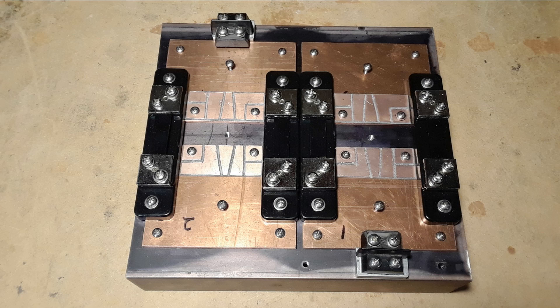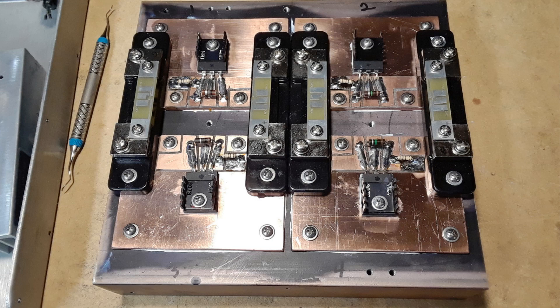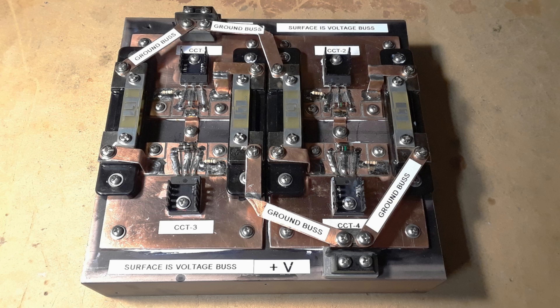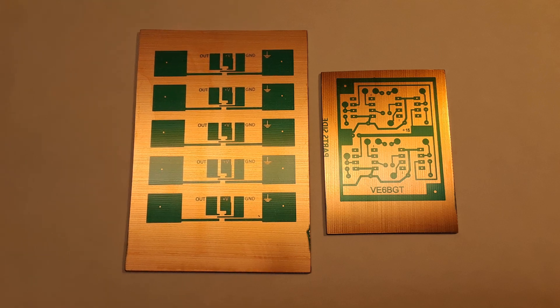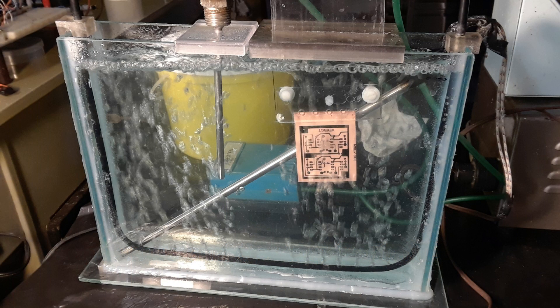So I found a much bigger heat sink, located where the four shunts were going to sit with the four copper heat spreaders, and the small chunks of circuit board that the MOSFETs will solder to. The MOSFETs and the heat spreaders are screwed to the heat sink with no insulation, so the whole heat sink will be at voltage potential. The small circuit boards on the shunts will be for instrumentation amplifiers later for the current display. Parts are soldered down, there are small heat sinks put on top with the bolt holding the MOSFETs down, and then eventually the copper bus bars to interconnect all the circuitry together. Before this I had to build some circuit boards: the amplifier boards for the shunts and the control board for the four op-amps that will run the MOSFETs.